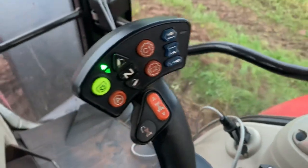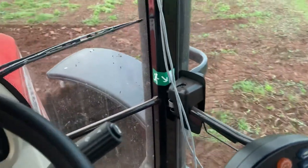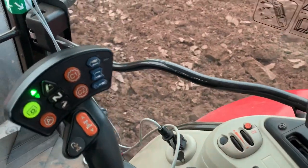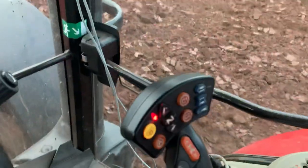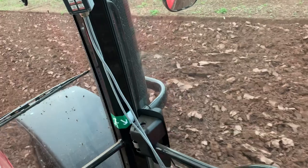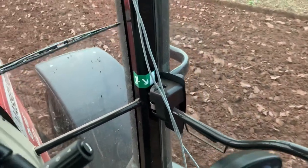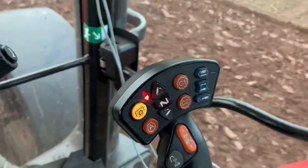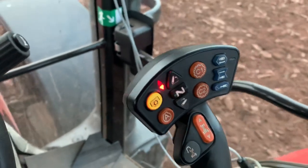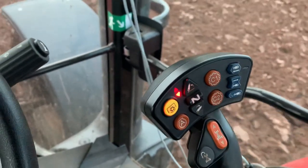But when you are in reverse, forward is down the gears and back is up the gears. People ask why. Massey say that when you're looking round the other way, when the tractor's in reverse, the gearbox should work the opposite way round. I don't know if I completely agree with that. But since the 6480s and 6490s, they've all been the same on the Dyna 6 — changing the opposite way round going backwards, and the right way round going forwards.